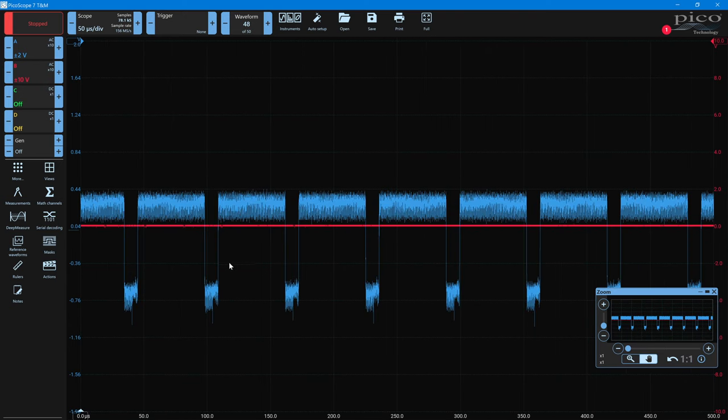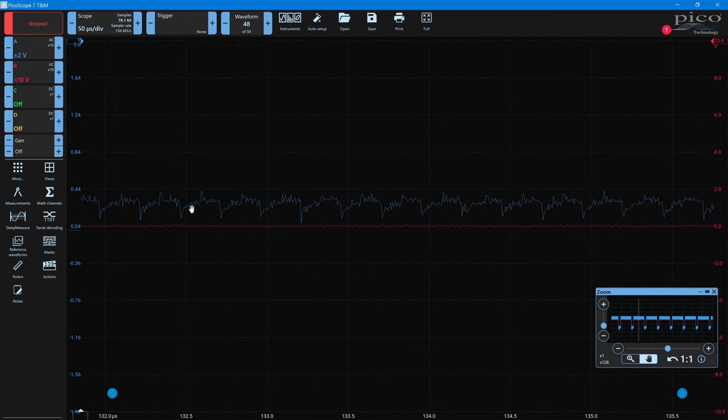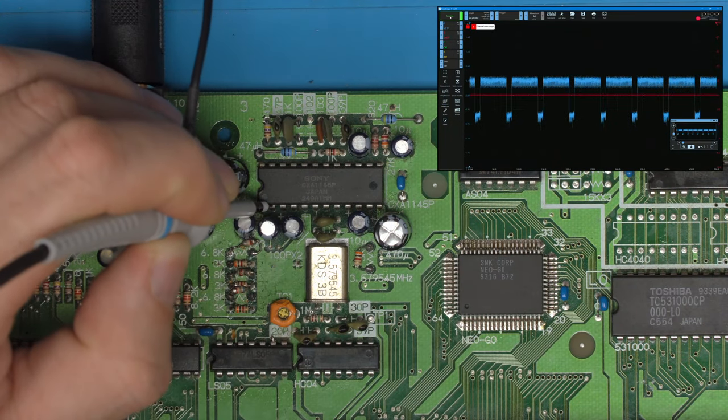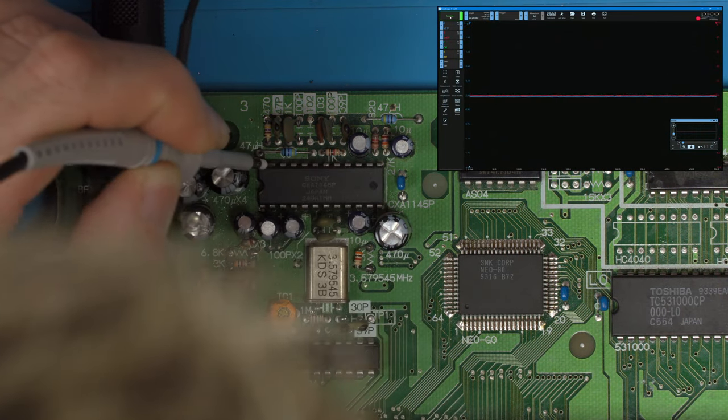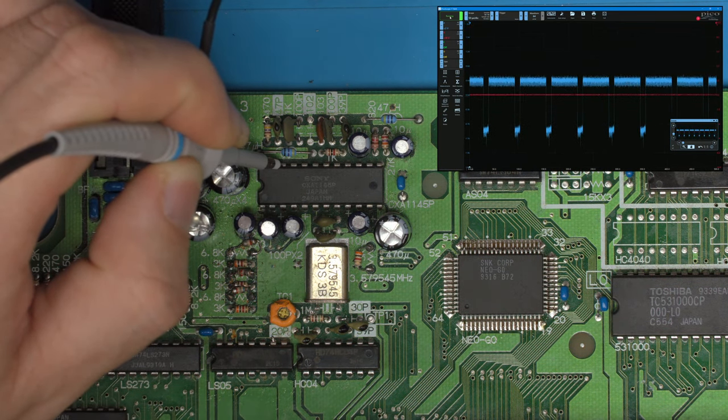And then another sync. So every gap here is a line, and all this should be solid red, green, and blue. And because we're on a white screen, this should actually be a solid, completely flat line. And we've got some clear indication of noise here. There's definitely an issue on the input, and then therefore effectively on the output it appears as well, even worse.